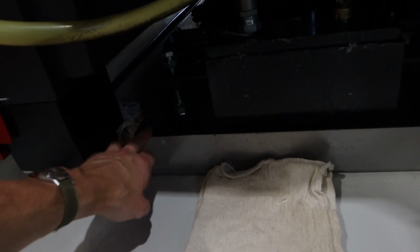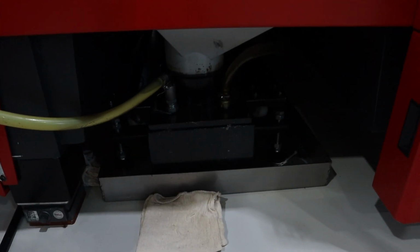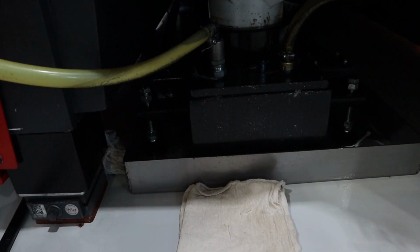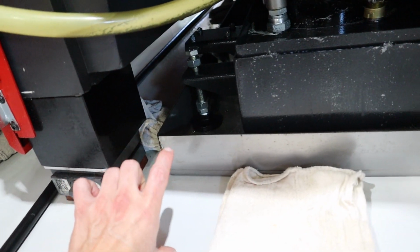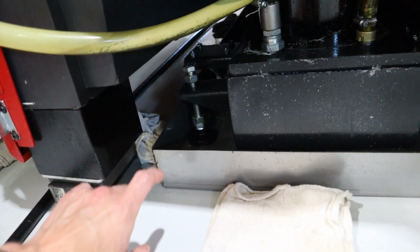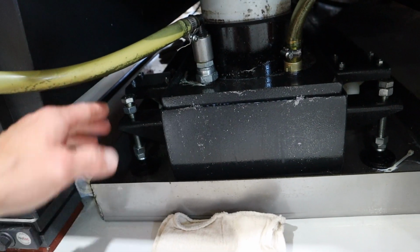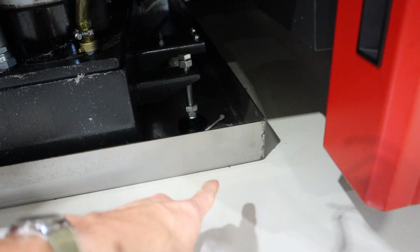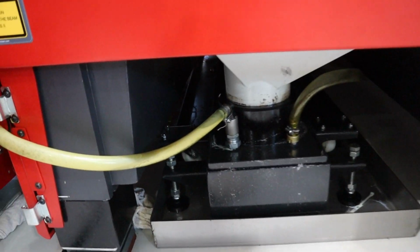So we ended up having this stainless steel drip tray custom made for us. I designed it in Fusion. I figured out how big it needs to be, and we had a local guy make it for us. And it's been an absolute lifesaver because it's 3 inches tall, so it captures quite a bit of fluid, and anything that leaks out of here now falls into here where we can easily vacuum it or soak it up, as opposed to making a drip mess, you know, finding gravity to the door basically.